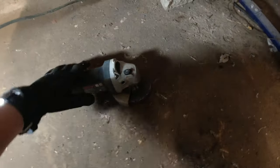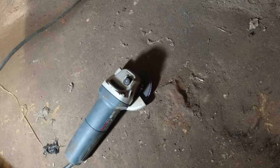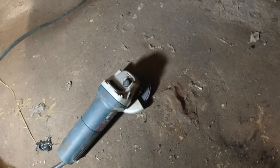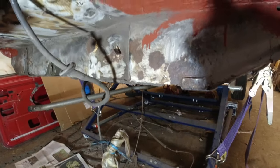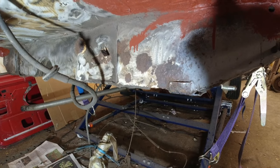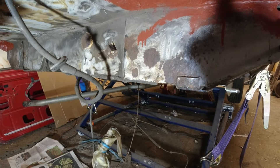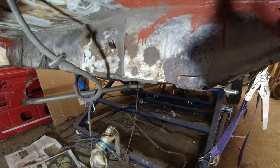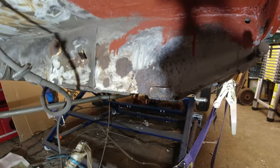I'll show you what tools I'm going to use to get this cleaned up. The tool that's got to do most of the heavy lifting is my angle grinder with a stripping clean brush on — it's like a fiberglass or fibrous brush, absolutely fantastic. Will take you back down to bare metal in no time at all. There are obviously going to be bits I can't get at, like corners, so I'm going to use a rotating file — like a very thin belt grinder or sander. And I've got a wire brush as well that I'll use to tackle some bits.